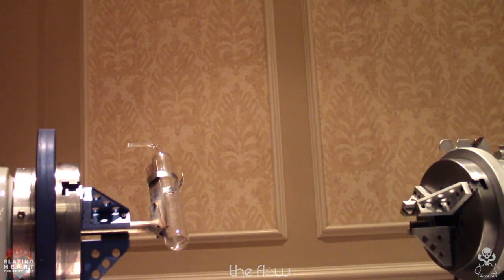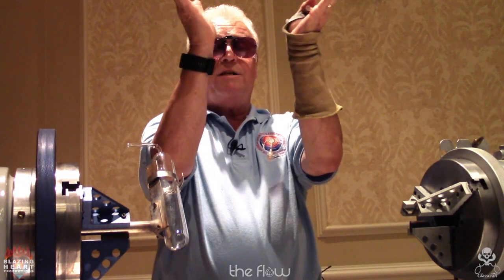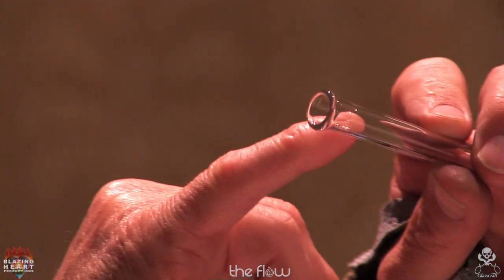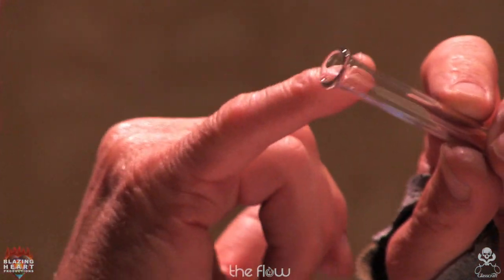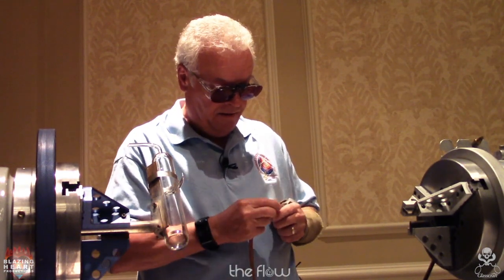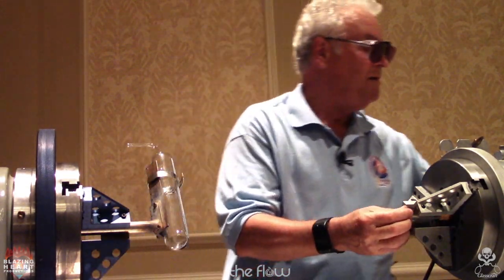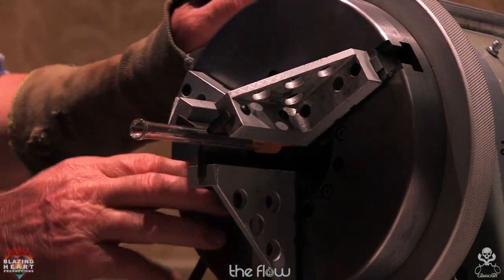I grab another hose connection. I should talk to you about the hose connections. I like my hose connections to look like the end of a trumpet, where it comes out, or a tulip, where it's nice and flared, a little weight gathered up in this area. You make your splice out here. You never overheat. You watch the splash of your flame so it's not going this way, and then this will not heat up and shrink on you. Hope this is long enough to get out. Yep. Not used to not having a lock on this.